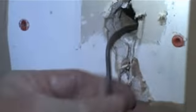Sometimes you'll have a situation where there's a boiler with one transformer and an air handler with another transformer. Well, the boiler would be on RH, we take this jumper out of the way, and the air handler would be on RC. But that's not the case here. We have a furnace and one transformer. All right, I pull this out carefully. Now, we have to make sure this doesn't fly back. There's no pressure on it as such, and I've bent it a little bit. Now we have to get that wire that's down. I'll take care of that spool of wire down there.